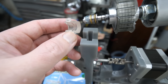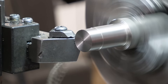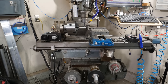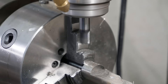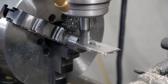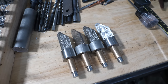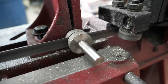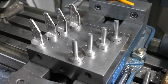Except now I've experienced most of the failure points and can design around them. To save weight, I made tiny aluminum shafts to control pitch and retain the blades — I'm increasing their diameter and machining them from stainless steel. It's much harder on tools, but that tells you something about its strength. The originals were starting to wear out the aluminum hub, so I'm adding bronze bushings that press-fit into the hub. And since the ultimate goal is to have two turbines on the car, I'm making a second set of everything to minimize my setups.